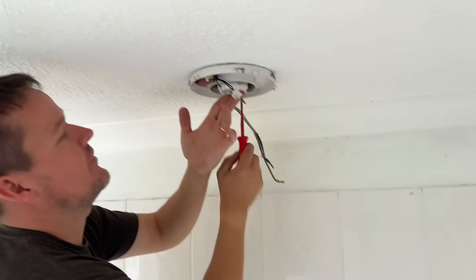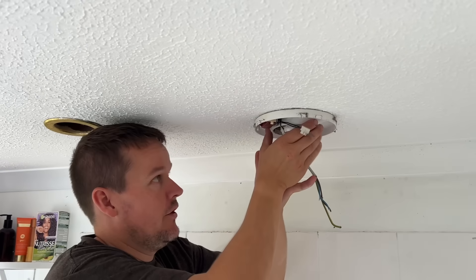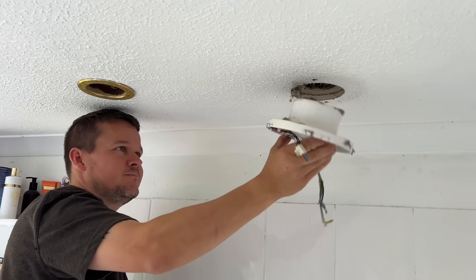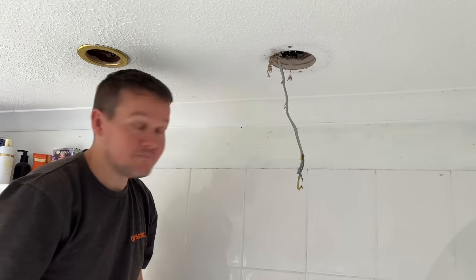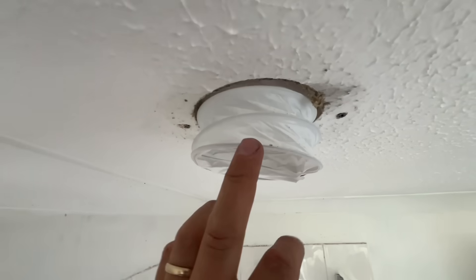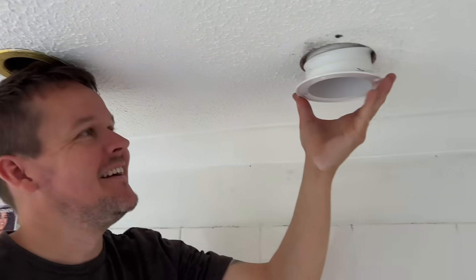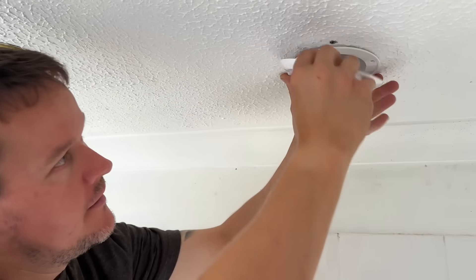It's the old red one, James. This is not too bad — I'll sweat that bit but it's double board. Right, this is what I mean — get your duct in first and then put the grill up, because it's much easier to do here than scrabbling around in the loft with cable ties. You could put insulated ducting on this but it's less than a meter so it's going to go literally up and then straight out the wall. If it was going across the house then definitely put insulated on it because it will condense. Cable tie — nice, push that up. Don't have to make good there — punch them through, screw that up, and put your grille on.